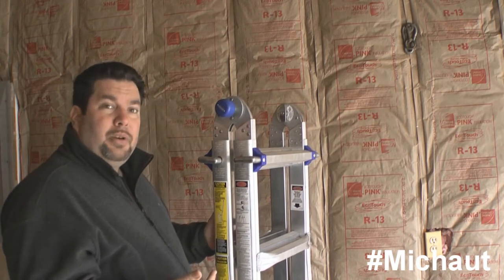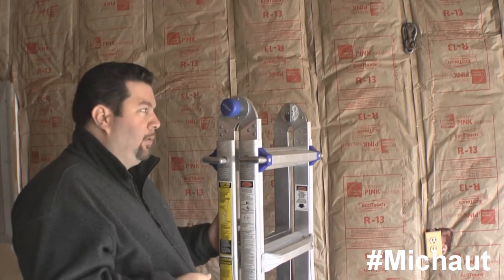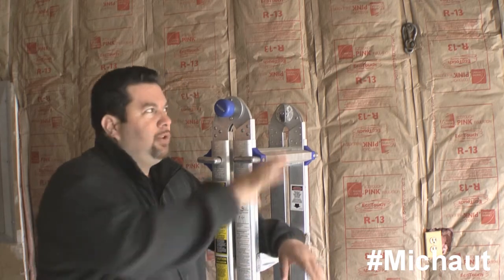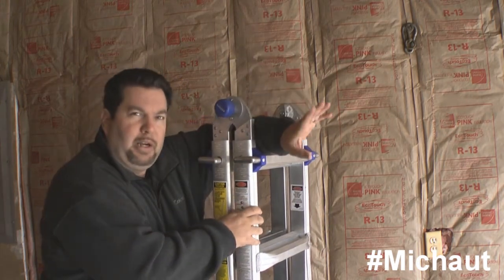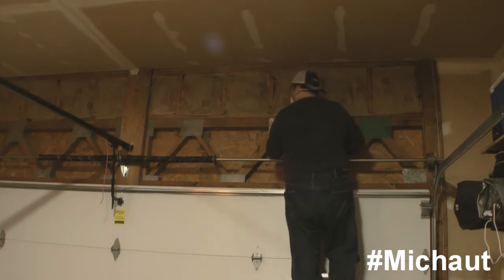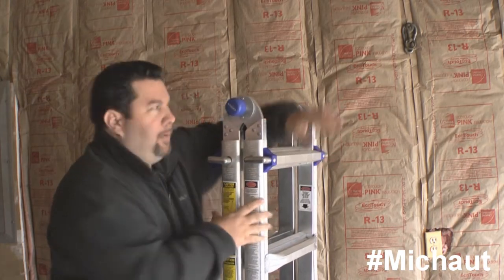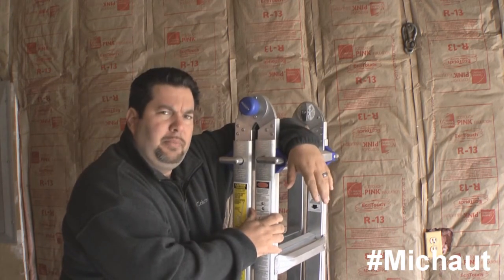If you are a DIY person, it's very likely you're going to use this ladder quite a few times for other purposes. Something with odd angles — for instance, there were a few pieces in the top part of my garage that had triangular shapes I had to fill. Foam would not be a bad idea for that. If you have odd angles, go with foam. But if you have these long, tall, straight spaces, batts are the best things you can buy.